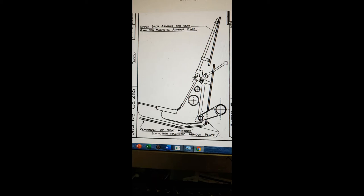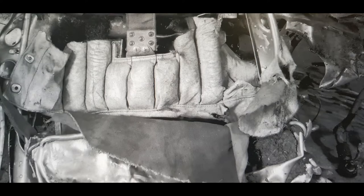The pilot's seat was fairly typical of the seats found in British combat aircraft in World War II. However, it differed in detailed design so as to allow access down the inside of the rear fuselage to service and re-pressurise the retractable tailwheel — not uncommon and greatly disliked by ground crews due to the accessibility and very tight confines of the fuselage.